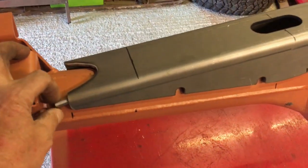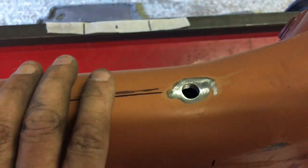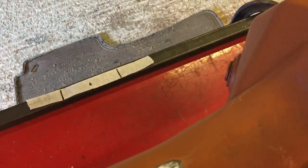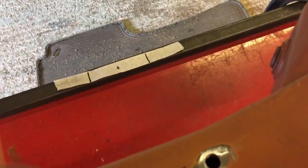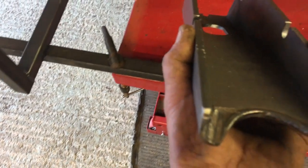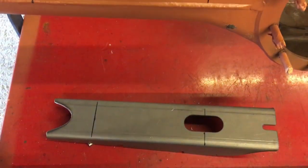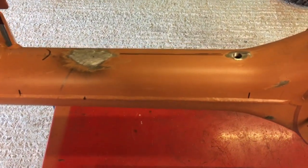Just to finish off — you can see I've done some work inside the box here. I've turned up this tube which has got a six-and-a-half mil bore so we can put some grease in there, fit the tube, and that'll be our breather tube sorted. Down in here I've drilled and tapped a hole. I've welded up the original breather hole, and I've got this one up here drilled and tapped which is going to accept the Gwyn Lewis brass elbow. Hopefully it's not too close to the diff to cause splash problems, but if it does I can make up a little something on the end to stop it. On the inside I had to use a milling cutter and then grind it out so the tube could go in there. We've now got protected tubes pretty much both ends, which is a good thing. Thanks for watching — I'll see you all soon with part four.